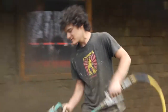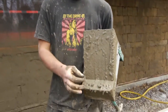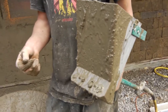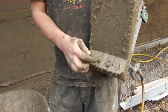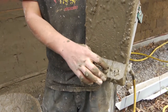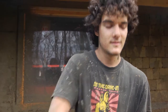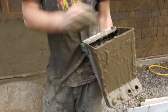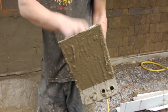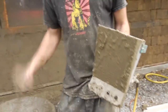One thing I forgot to mention in my stucco instructions: if you're using a plaster sprayer, it's really important to screen all of your sand and clay through a quarter-inch mesh, otherwise you get rocks in there. I'm dealing with rocks from clay that I mixed haphazardly a few weeks ago in mass. It makes things a lot more efficient if you screen all your materials before mixing.